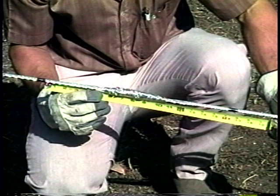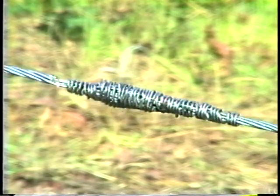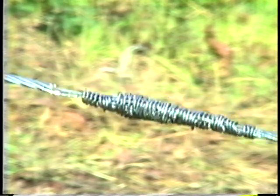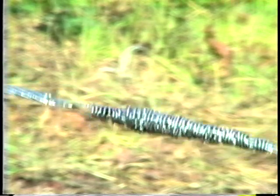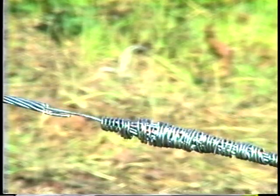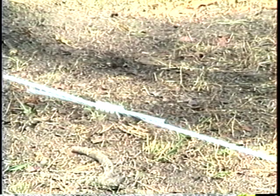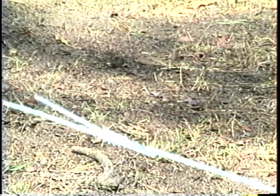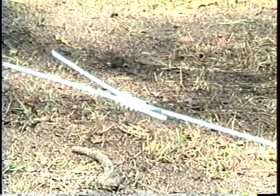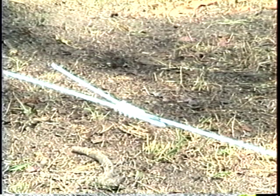When the Western Union splice is tested using a dynamometer, it began stretching immediately. At approximately 700 pounds, the splice pulls apart. Note that it fails at a rated load less than the rated conductor strength. Using the dynamometer test on a connector shows that it loosens and pulls apart at a force of approximately 400 pounds. Again, note that it fails at a rated load less than the rated conductor strength.